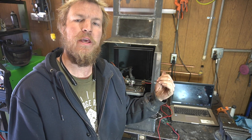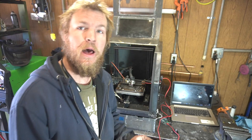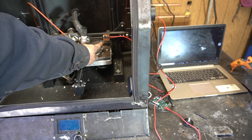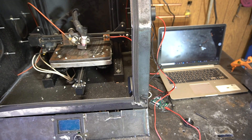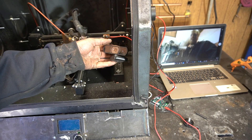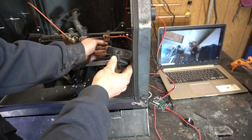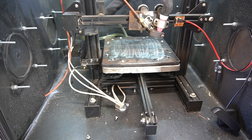What we're gonna try and do here — I wanna run it in vase mode, just print a cute little vase and see how that turns out. There's a funky new limit switch in here. This limit switch goes to an Arduino Leonardo hooked up to my laptop, and the Leonardo is running the keyboard library so it can emulate keystrokes. The laptop is hooked up to this webcam, and every time the limit switch is pressed it'll take a picture. So now in between each layer the machine will trigger a photo automatically.